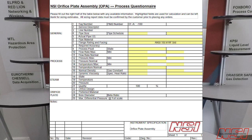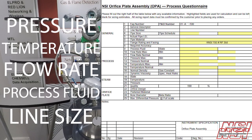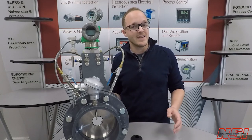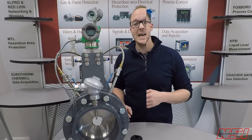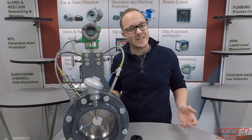If you're interested to see how our solution stacks up for your application, just fill out our NSI OPA process questionnaire. We'll take your process data and generate a custom assembly quote — of course, all with standard components. Our quote will come with a report that has all of your flow data for the orifice plate size we recommend, and will include flow data for one orifice plate size down and one size up, so you'll have a backup plan if any of your process conditions turn out to be a little off.